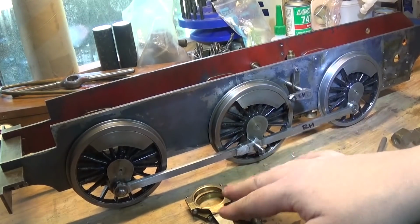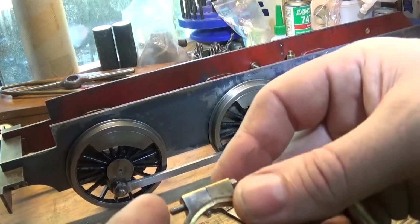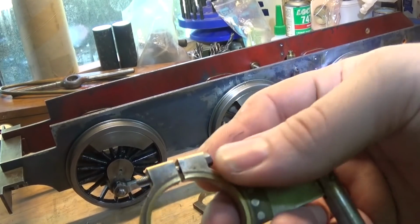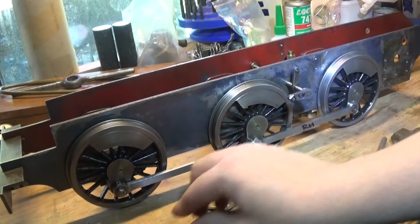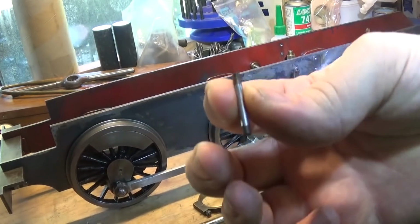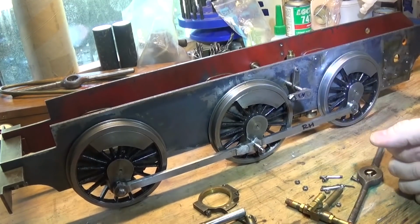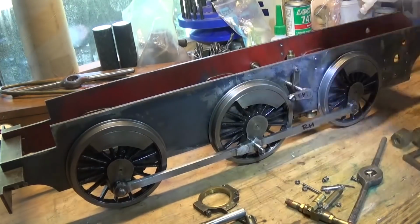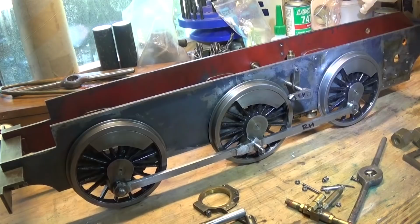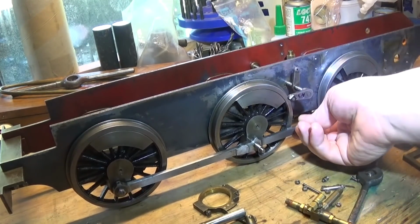I'm probably not going to put the pump back together just yet. I bought 5BA bolts because they're much easier to do up than the little studs that it had in it, and discovered that the studs are 1/8 Whitworth, so the nuts don't screw on. So that's a job that I have to do, is find some 5BA nuts somewhere. There might be some here I'll discover over the course of the day. But at this point there isn't.